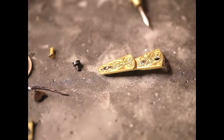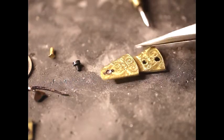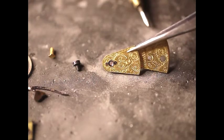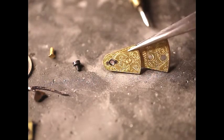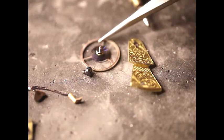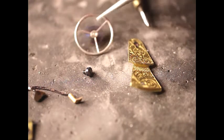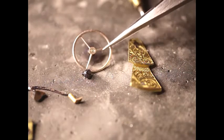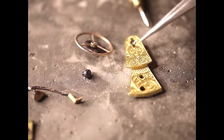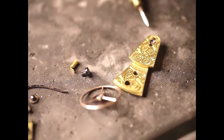So far I haven't looked at the rest of the clock, and it may not be necessary to do so, because essentially we have this rather only bridging piece here which has a cracked jewel cup, which just needs replacing I think. The arm here — one of these is dinked. The jewel's intact and the spring's pretty good. The bottom part, I think that's called the staff — the bottom part of the staff's pretty good. But the top of that looks like it's damaged, and that's probably why it's not reaching the top of the bridge.